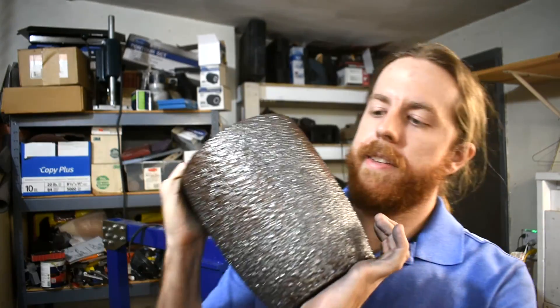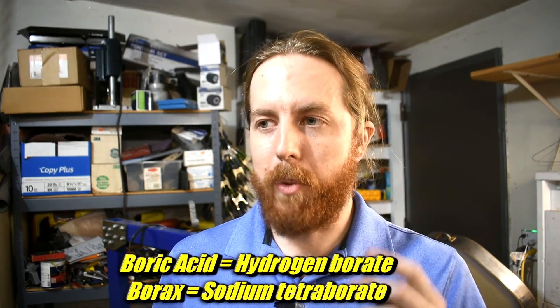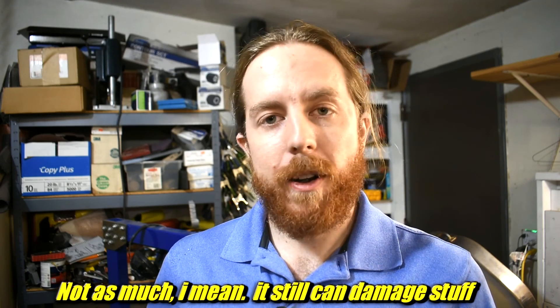Clearly I'm melting the glass part out. So why wouldn't you use flux? Well, the one I showed you was heated at 2100 degrees without flux and clearly the glassy stuff is melting out. If you put borax on — and borax is a really strong one, boric acid is probably better, it's not quite as strong — those particles will melt at a lower temperature. But it will re-solidify and harden when it cools, and then the next time you heat it up that hot, it's going to melt again. In a sense, it accelerates the crucible melting and crumbling apart. I had a crucible that I used a lot of borax on, and it basically turned into rubble — like a block of loosely held together gravel. It was bad.